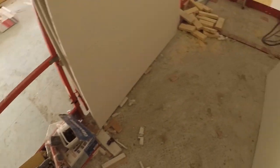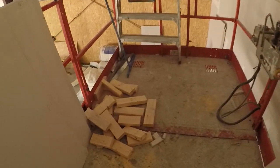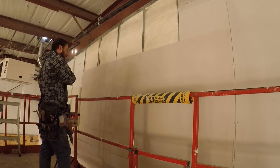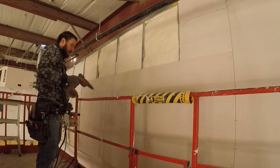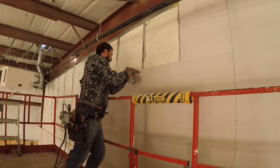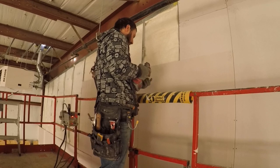What I do is I go ahead and I measure all my tops. Then I cut them all. Then I put them on. If I'm working with an apprentice, I'll have the apprentice go ahead and cut them all, and I'll put them on. Make sure you got everything you need up on the lift with you. Here, what you're doing is you're obviously going to screw in the studs from the sheets below. Get that done and out of the way.